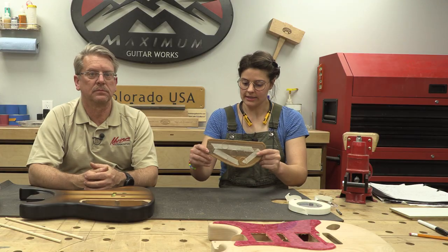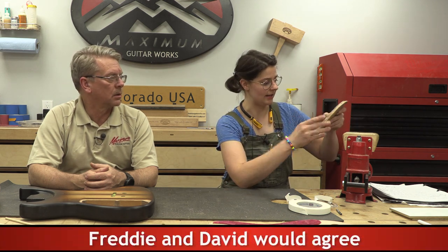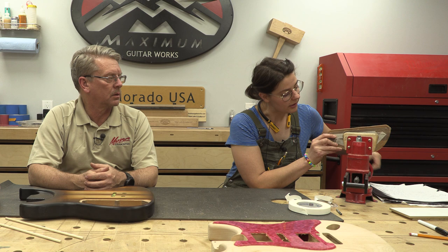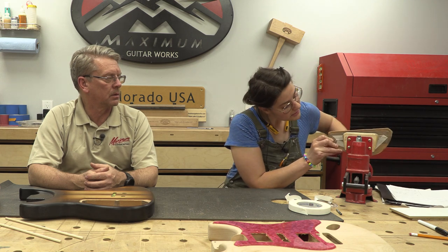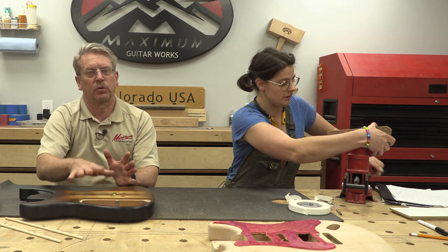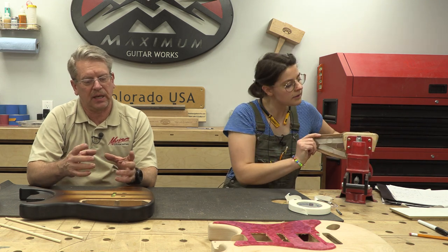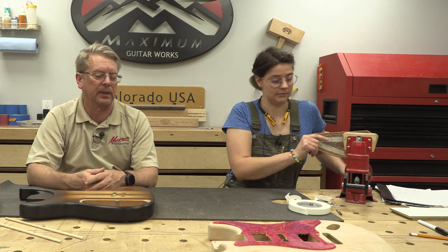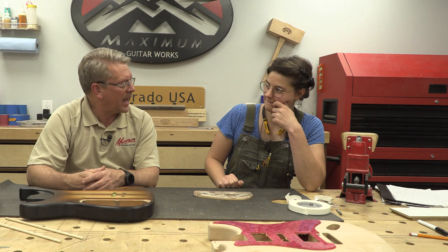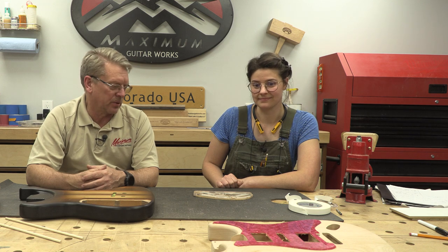One final safety measure with this tape is to put some pressure on it, and that will help it stick more and bond better. And so you can do that with this vise. Worst thing is when you got a one-of-a-kind piece of wood that you're going to be putting on there, and that template you thought was double stick taped down perfectly, and it shifts as you're pushing into the router bit, that's not for a good day. And we've put too much work into this. We want to have a good end of the day. So let's go to the router table and flush cut this.